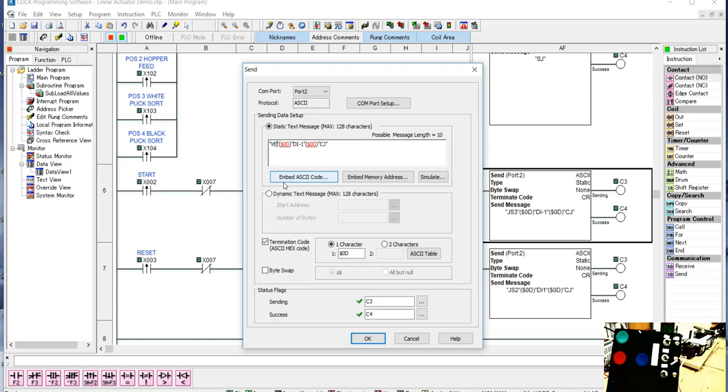Now, we have to put in a velocity, and again, it has to be capped, so I'm going to make it velocity 3. And now the only other command I really need to do is, well actually, we don't even need a velocity command, but we can put this one in here. I'll put one with the velocity command, and then I'll put the other one with just the steps. So for all these steps, I'm going to run it out for 200,000 steps. And again, that will be 10 revolutions of the motor.